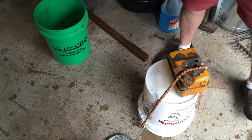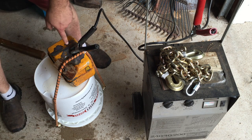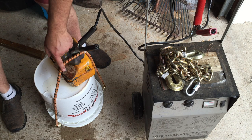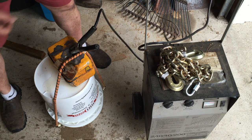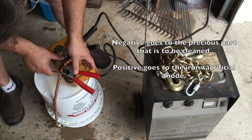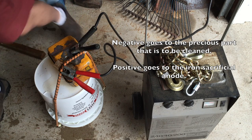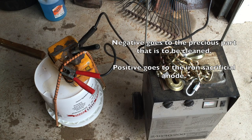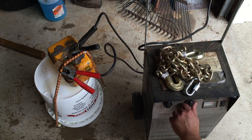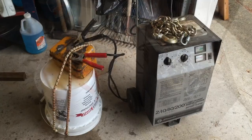The reason I decided I'd better get a bungee cord is because I'm gonna be using a big 12-volt 200-amp booster as a battery charger on this. I've already hooked up ground to the cathode — the outside of the tank is the cathode. Our sacrificial anode is our bolt; it is not touching the cathode. I plug the positive on, making sure the sacrificial anode doesn't touch, so we're not doing a dead short. Then I set this to 12-volt 2-amp and turn it on.